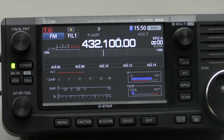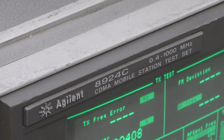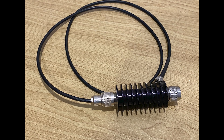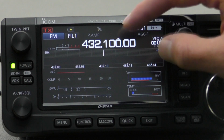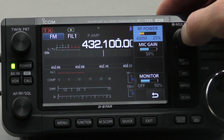He found out that he was getting 6 watts out of his IC705 on 70 centimetres. So what I thought I'd do is hook my IC705 up to my test set — my service monitor, which is an HP or Agilent 8924C. What I've got here is about a 1.5 metre length of RG58 which goes into an AeroFlex 50 ohm through-line dummy load, and I'll be able to read the output power on the service monitor from the radio. I've got my radio set up here on 432.1, with the RF output power set at 2.5 watts, because that's what I usually run for my transverters — that's the power that I drive them with.